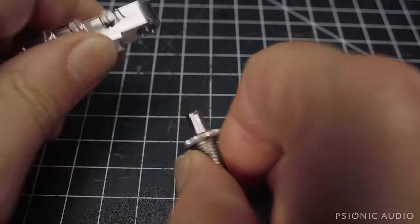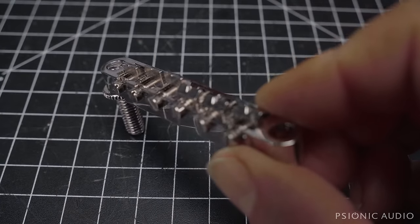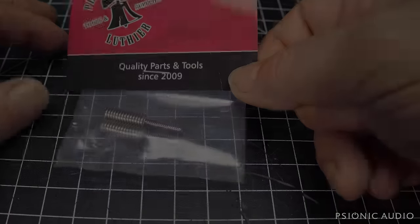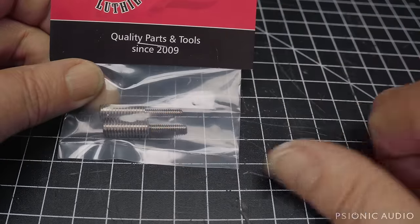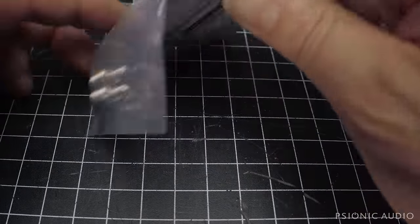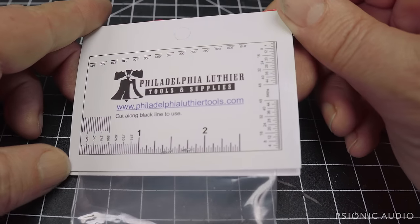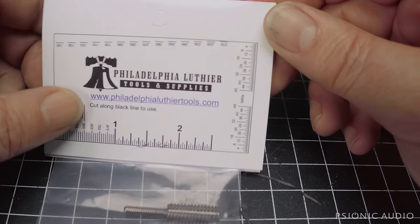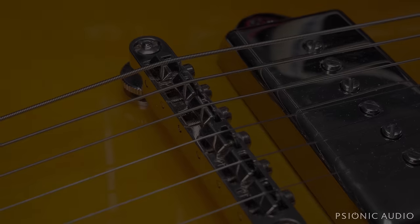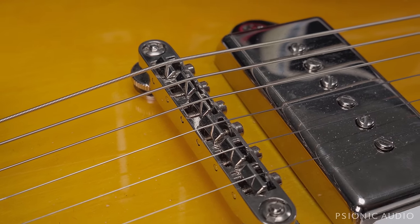I wanted to go to a true ABR as opposed to the Nashville because I happen to have a spare true ABR bridge here. So I found these conversion posts from Philadelphia Luthier Supply. I'll have a link in the description. $9 a pair, nickel, no brainer. It goes into the metric Nashville insert in the body, and then gives you 6-32 upper portions for a standard ABR to go into. Very nice solution. If you prefer, you can just change out the saddles, or you can get a different metric bridge. There's lots of options out there.